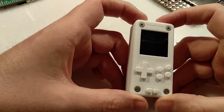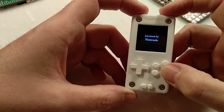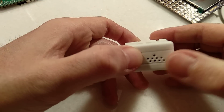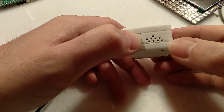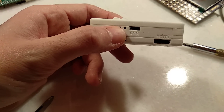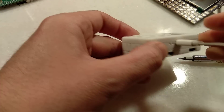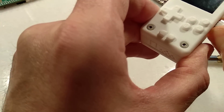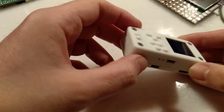Once the game boots you can check you've got audio, which we appear to have here. That comes out this little speaker hole. The hole at the top is actually the LED hole. There are also a couple of holes to indicate whether it's charged or not charged. So if you put the charger in, obviously you get an LED for charging, and the other one will light when it's charged. I will throw in with the kit a little bit of clear 3D print filament which you can just push into these holes to make little light pipes, just to make it look a bit better.